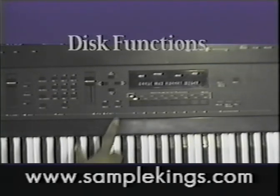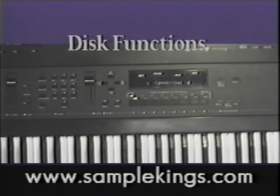Press Enter Yes to proceed. While the EPS is formatting the disk, your display will read Formatting. This process takes about a minute and 20 seconds. When the formatting is done, the display will read Disk Command Completed.